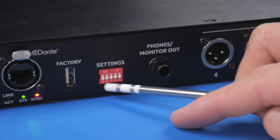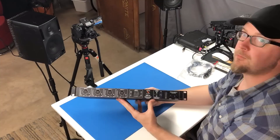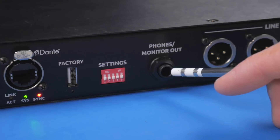Switches 1 and 2 control the input side. Switches 3 and 4 control the output side in much the same fashion. These options for both the input and output configuration make interfacing with other equipment and maintaining compliance to various standards really simple. Next up, we have that rear headphone monitor output that disconnects automatically when the front jack is used. This can be really handy in situations where you might want to use that rear panel output to feed a powered monitor speaker, but when you plug in your headphones, you want those speakers to automatically turn off.